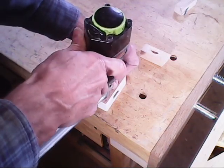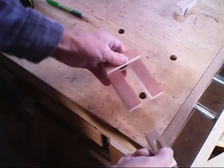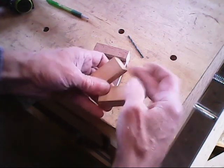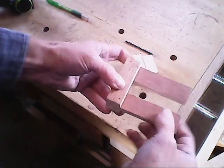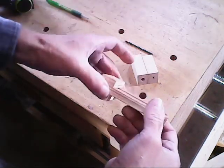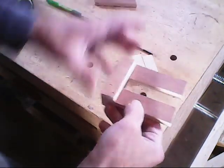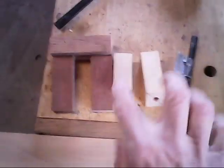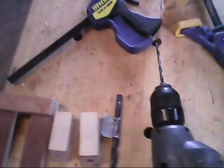And there's our jig block right there — our fixture. That one goes in there, and the next one goes in like that. Remember we cut our blocks in the front here to be referenced, so that when our bit comes through, it ends up in the proper place on the workpiece. So this could be our jig now for clamping. The whole system right here: our two drill jig blocks, the fixture for putting it into, our countersink head bit, the shank bit for the screw shank, and two clamps.